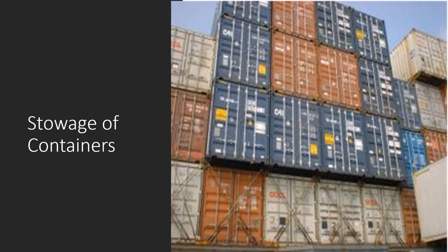Some containers are jutting out — those are 45-foot containers. They do not sit exactly on 40-foot containers because they are longer, so they protrude. Sometimes you cannot put lashing bars there, and those containers are then locked in by the twist lock system. However, 45-foot containers do have slots available for lashing bars, and you can see how lashing bars go into the 45-foot container slots. Although they jut out longitudinally beyond the 40-foot containers, double parallel lashing can still be done, with even the first high 45-foot container lashed using a lashing bar.